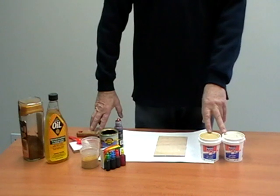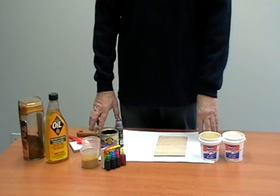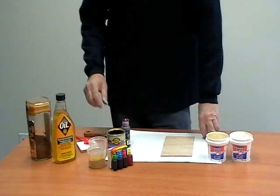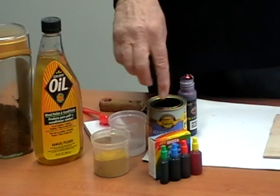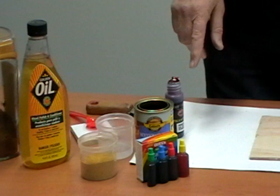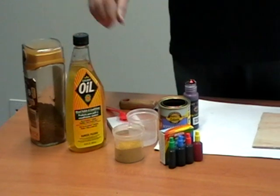When it comes to colouring, the beauty of Timbermate — being non-acrylic, latex and solvent free — is that it takes all kinds of stains or coatings. Whether you're using an oxide, food colourants which are water based, a stain, a spirit base, a bit of oil, or even a bit of coffee, it will change the colour for you.